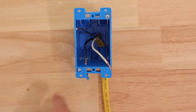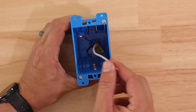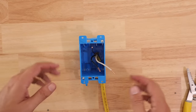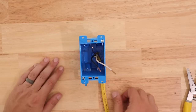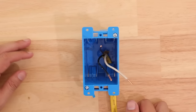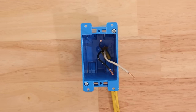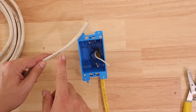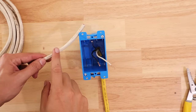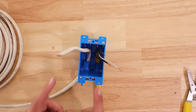So the next big mistake I see being made also goes back to wiring size. Let's say you've already got an outlet box in the wall, and this wiring here is number 12 or 12 gauge. You want to add an outlet or tap into it to power a light switch. You're going to have to run more wiring into this to send that power on to the next device. What I oftentimes see happening is instead of getting the same size wiring that's already in the box, they go out to their garage, find whatever's laying around, and this particular one is 14-3 — but if it were 14-2, a lot of people wouldn't think anything of it and would just use it.